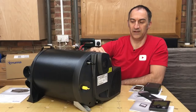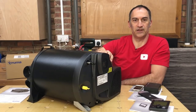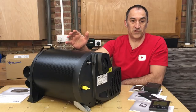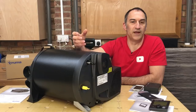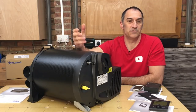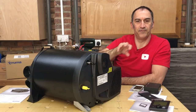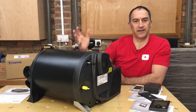It's a room-sealed boiler with a balanced flue, so the air inlet for combustion and the exhaust gases go out through a concentric duct to a terminal on the outside of your van - none of your combustion gases make it into the van. If you've got a little propane heater in your van, one of the byproducts of burning LPG is that it produces moisture, so you'll probably have condensation issues. With this boiler, the air for combustion and the exhaust go directly outside and nothing enters the vehicle.